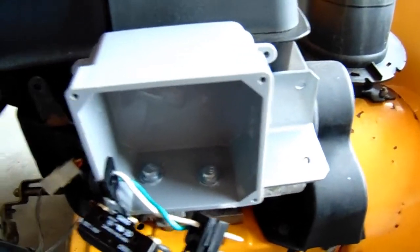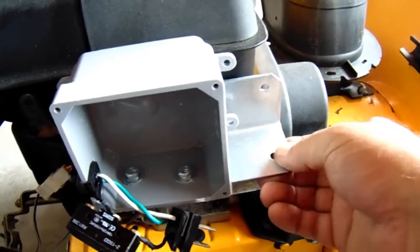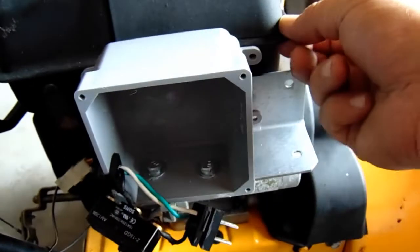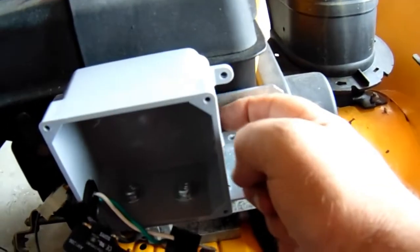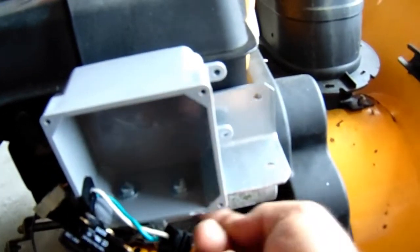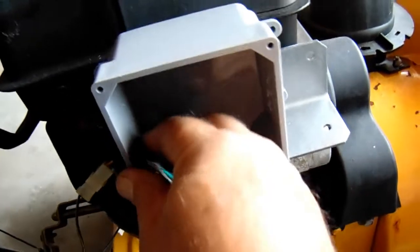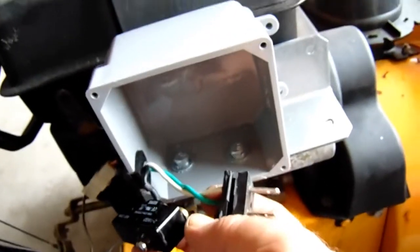What I've done here so far is I took a bracket I found at Home Depot by the lumber — it's a big L-bracket, about six inches long — and I mounted an electrical box to it. This angle bracket is using the two bolts that hold the gas tank. I mounted the box a little bit away from this to allow for the bolts, then drilled holes in the bottom of the junction box and put some bolts and nuts in there. I took the oscillating tool and cut about a half-inch groove in there, and then this cord relief fits in there perfectly.